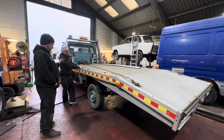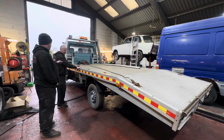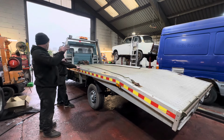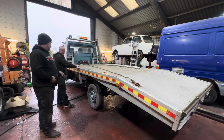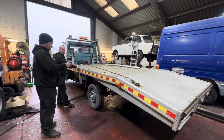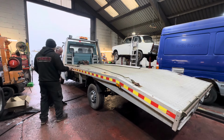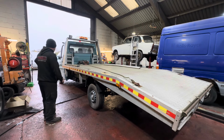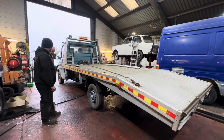So what I'm going to do, lights, bolts. We're going to need some body bolts, stainless ones. We're going to have to tidy that bit of structural member up, because we cut the edges off of it and it'll be open steel now. So we'll do that again. And then I think weldy wise, we take these wheel arches off, bolt her down, grind it back, cut it, acetone it. And I think we can ali MIG weld that, rather than trying to TIG it.